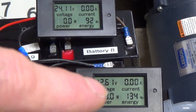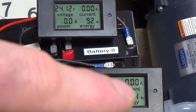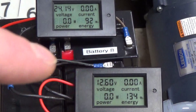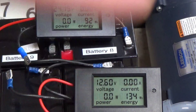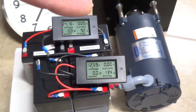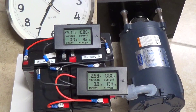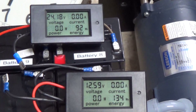The voltage will drop and these batteries would have had to go into the 14.5-volt range to actually get a really good charge. I don't think it would be possible to do that with this configuration — you would probably need 36 volts on the front end to get these to charge at that level without losing RPM on the motor. That's the big thing many may not be considering, and I don't know where the belief comes from that there is some kind of advantage, because clearly there is not.